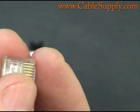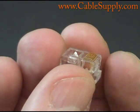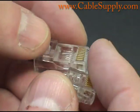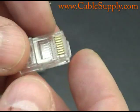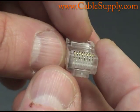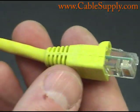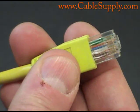Just to give you an example of the difference between an RJ11 crimpable mod plug and an RJ45 — here is an RJ45. Notice the difference. RJ45s are basically used for computers today. The telephones that use RJ45s are your Voice over IP telephones. Here's what the RJ45 looks like when it's crimped down to a patch cord — it has a strain relief on it and it's all punched down. You can see the wires inside.